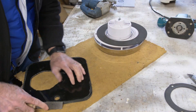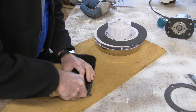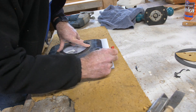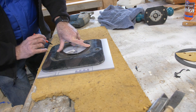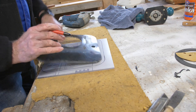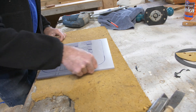So the first thing to do is to clean up the old plexiglass and get all that old caulking off so that I can use it as a template. Once that's cleaned up, I'll mark the outside of the old plexiglass onto the new Lexan and then cut just outside of the line. I'm using the two square edges of the new plexiglass so that I don't have to cut those two edges — I'm just cutting the two remaining edges and rounding the corners a little bit.